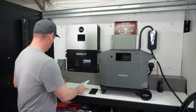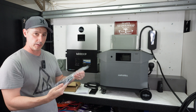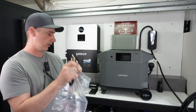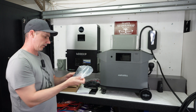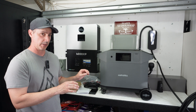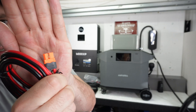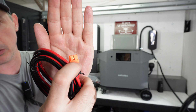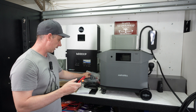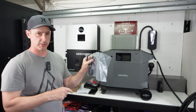Some of the goodies you get when purchasing this unit: we get our AC adapter for the 1,600 watts of charging, a barrel plug connector — barrel plug to barrel plug — alligator clips to cigarette socket, and an XT60 to cigarette socket as well. This unit did not come with solar cables, so I had to buy some on Amazon. These ones are a little different — there's a little piece of metal in the middle, which signals to the unit that it's coming from PV cables, whereas the regular XT60 clips without the metal indicate automotive input.